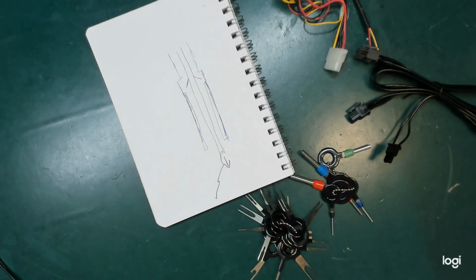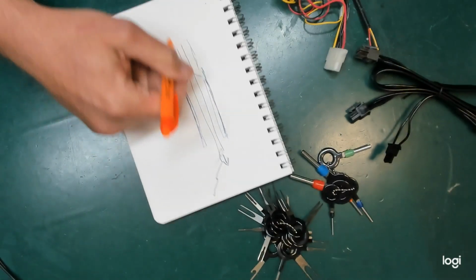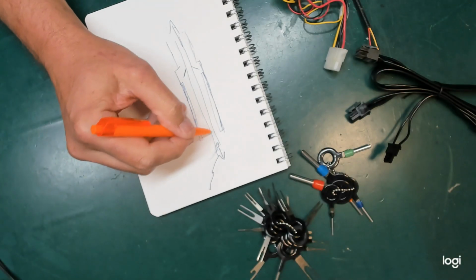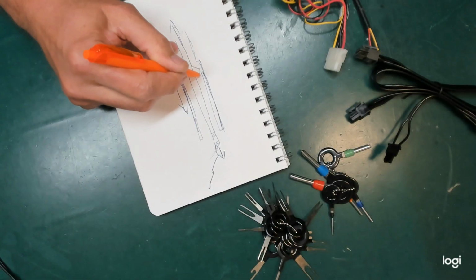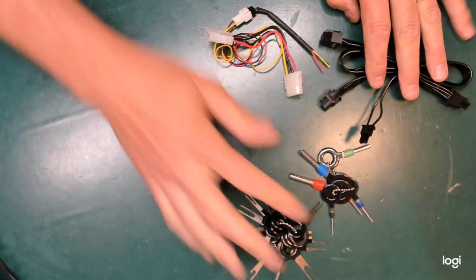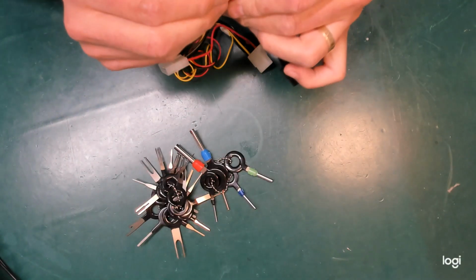And the way that this pin will come out is either the cable's missing and it can be forced through that way, or the cable is still attached, or it can be grabbed with some long nose pliers and it comes out that way after these little fellows are pressed back in enough so they clear the plastic. And that's what these tools are for.